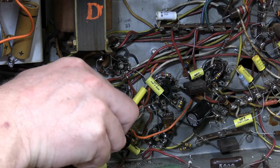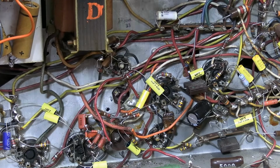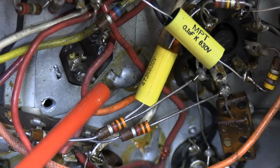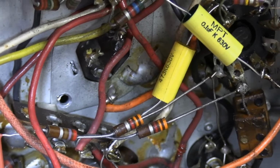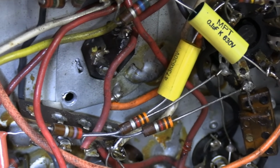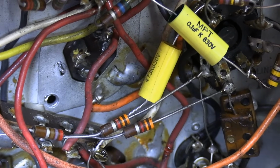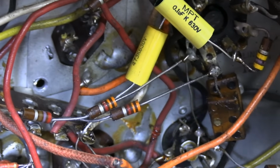And yeah, I know there's other ways to do it. I could try cutting it open from the top side and drill down holes from the top side and run wires through. Actually, it doesn't look too bad. That blob right there. Another good reason to use a temperature controlled soldering iron is, even though it's only 65 watts, it should be able to melt that. We're thinking, oh, you need a 200 or 300 watt iron or gun. No, because it'll keep pumping more power into the tip to get it up to temperature, so it should do a decent job on that. Let's find out.